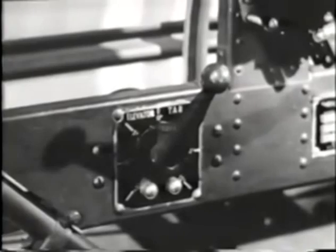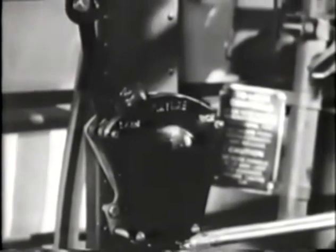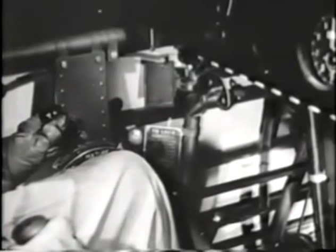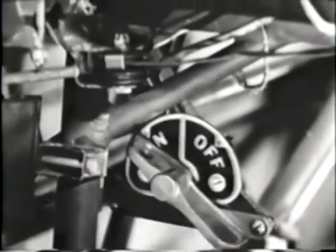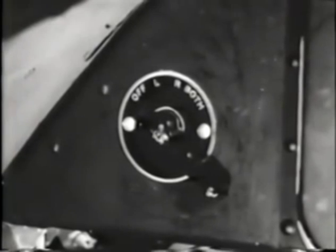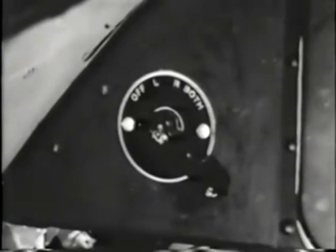In this airplane, the cockpit check begins with the trim tab regulator and moves next to the throttle and mixture control. Set the mixture, the lower red handle, for full rich, and open the throttle about an inch. Still further forward, underneath the instrument panel, is a red valve which turns on the gasoline, allows it to flow from the fuel tank down into the engine. Turn this to the on position. Directly above, on the instrument panel, is the ignition switch, which we've already mentioned. But check it again by sight and by feel to be sure it's off. Your plane captain's life may depend on it.